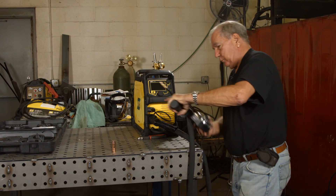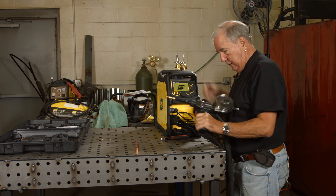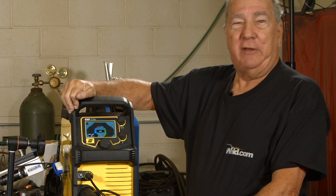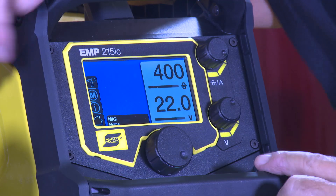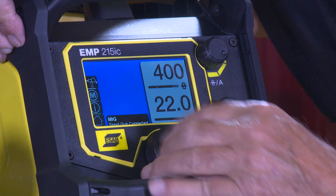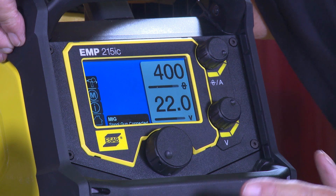Now I'm going to turn the machine on. We've got the spool gun attached and aluminum wire in the spool gun. The last thing we have to do is set the machine up and let it know we're going to weld with the spool gun. I have to go up to the MIG mode — just turn the dial up to the MIG mode. Once I'm there, press the button, get a display on the side, and at the very top you'll see a picture of the spool gun. Go up there, hit the button, and it'll say spool gun connected.